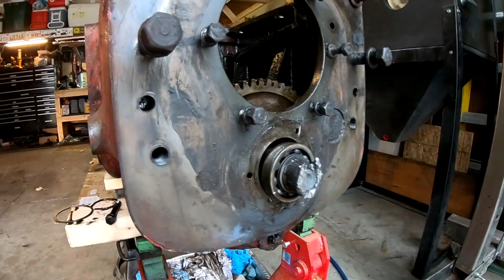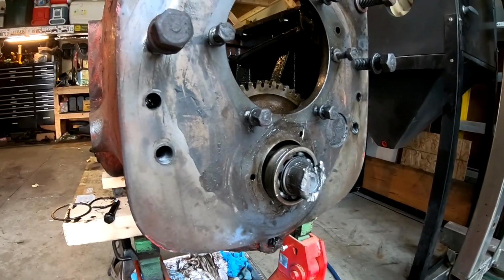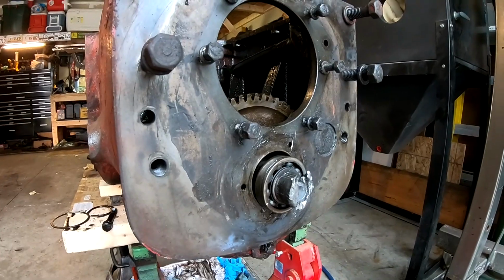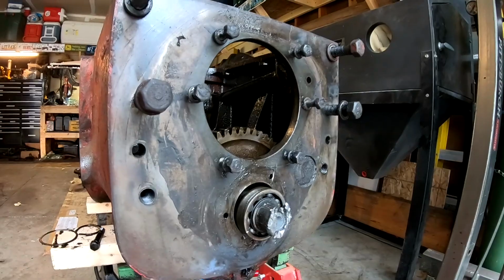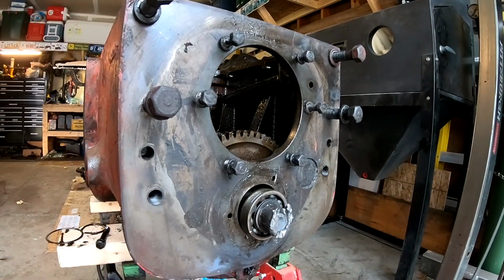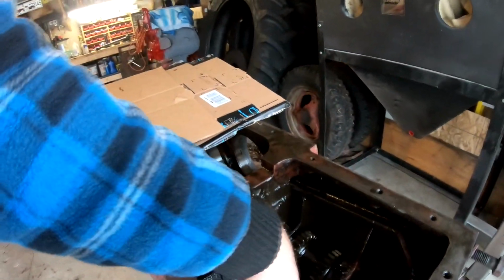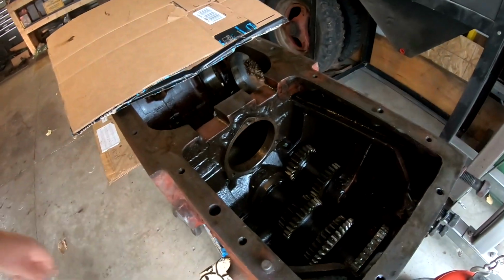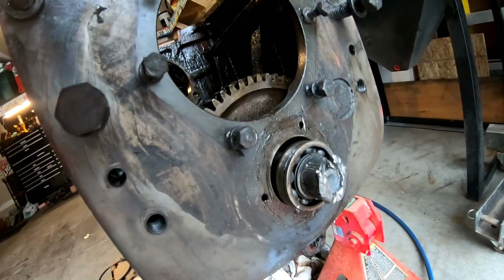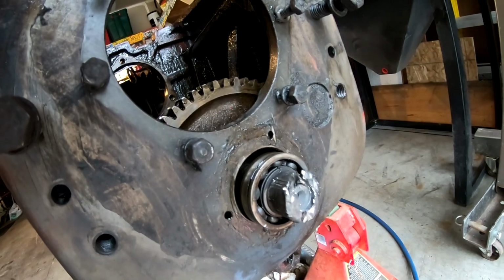I tried that 3 times. I used plenty of spray lubricant. I've tried an air hammer and chisel when the coupler was still intact. I tried a regular dead blow hammer and chisel. I tried a pipe wrench on here, and then a pipe wrench on the inside here, the casting wedged against the actual transmission casting. I tried everything to get that thing to turn off, and it would not move.